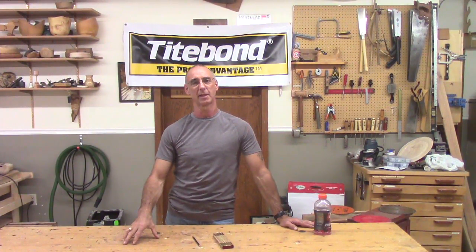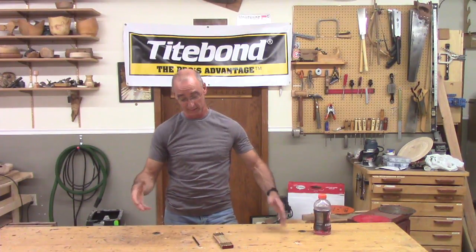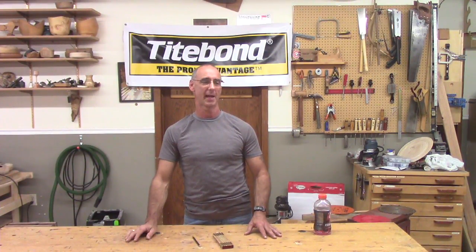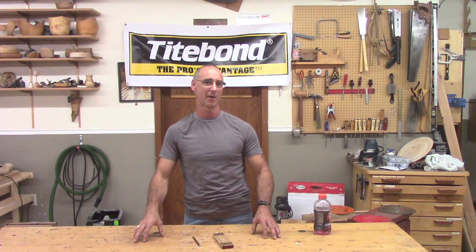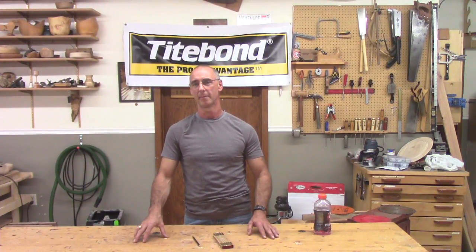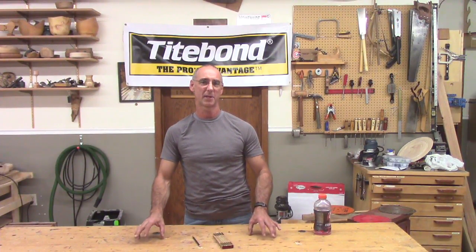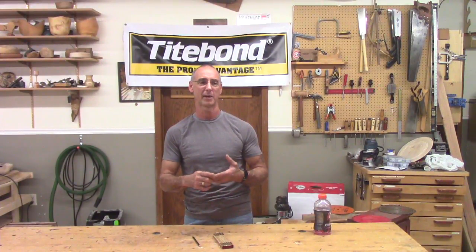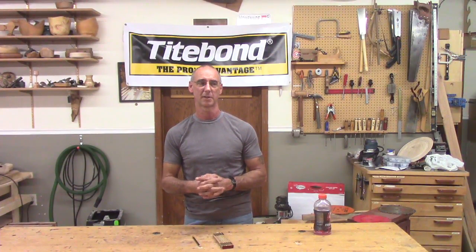I would do some more research on this outside of me, because you want a couple things. You want it to be durable, because it's like a workbench in your shop. You're gonna be using it all the time. So you want it to be durable, but you want to be able to set an apple on there and not worry about stuff migrating into the apple. So I don't know, durability would come from a polyurethane. Food safe would come from mineral oil. I don't know. Mineral oil isn't going to give you much protection over the long haul. So I think you need to do a little bit more research. I'm solid with the answer of hard maple. That'd be a great choice. But I'm not so solid with what a good answer would be for finish for that. A little more research.